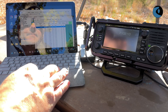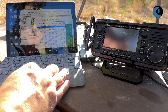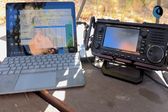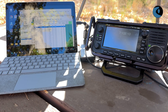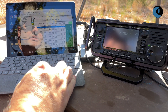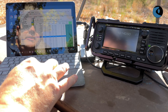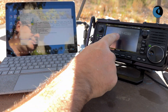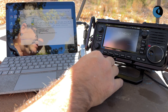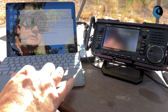Here are some stations on the 30-meter band. Let's see if we can reach one of those. In order to do that, I'm going to reach over and flip the switch on this antenna — we're now in the 30-meter position. This station is about 425 kilometers away from my home QTH. Let's double click and change over to the 30-meter band, then make sure the tuner is turned back on. We're tuned up and the AH-705 was able to tune that frequency.